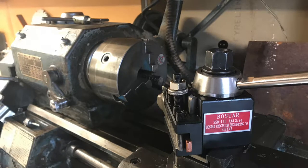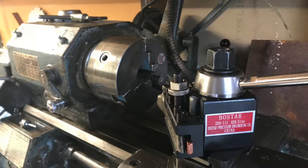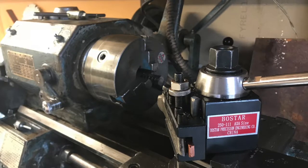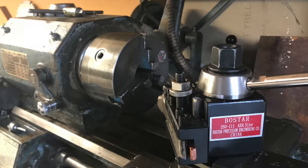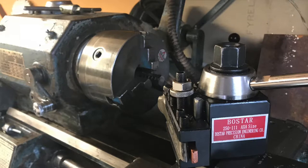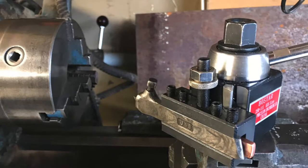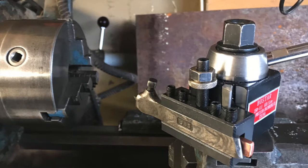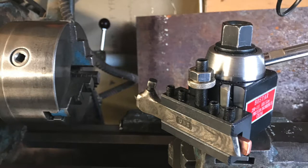Next I'm going to show you various ways in which the whole lathe system can be set up for doing different kinds of jobs, to give you a rough idea of the scope or range of different things you can do. This particular setup has a quick change tool holder — you turn the lever and take the tool out and replace it — and it's a metal cutting tool. The chuck is a three-jawed self-centering chuck, used for most standard engineering things like turning a cylinder or facing. This quick change tool post is not standard equipment on the Boxford lathe, which had a lighter device with a half-moon piece of metal that you could rock up and down. I didn't find that rigid enough.